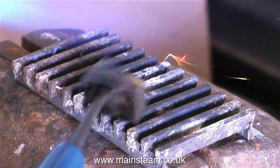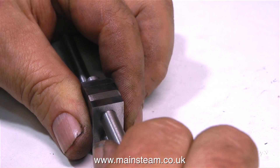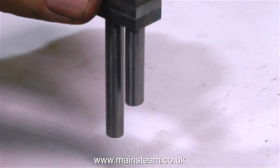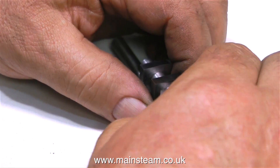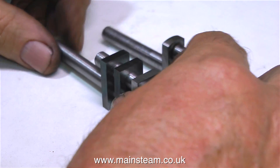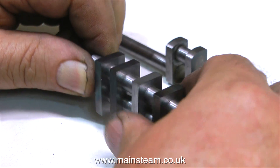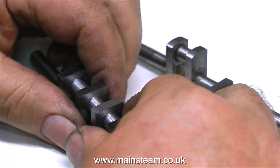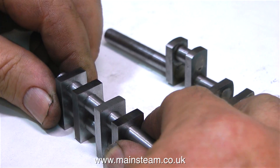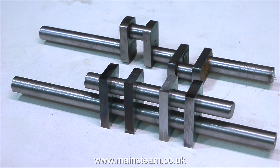After separating all four pieces and quenching them, they're cleaned up on 400 wet-and-dry sandpaper. The center punch marks made earlier on one end of each piece are crucial - they identify which end goes where to maintain accurate alignment from the machining process. The fit of the silver steel in the reamed holes is just right: enough clearance to allow Loctite to penetrate the joint, but not a rattle fit - best described as a snug fit, not an interference fit. The next episode will show the final assembly and fitting of the crankshaft into the main bearings.